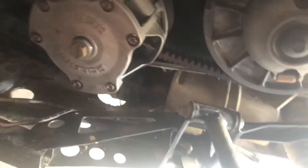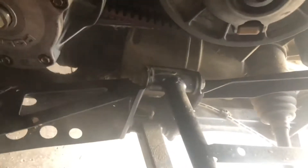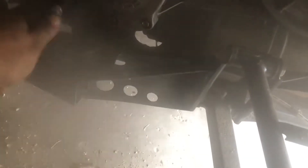We're inspecting the belt housing cover for debris and dust. As you can see, there's quite a bit in there. We'll have to figure out how that's getting in and possibly replace the seal around the housing. We're going to take an air hose and blow out the clutch housing and the clutch while it's still on the unit. You'll want to wear safety glasses and a mask while you do this, because it can get pretty nasty as you can see.